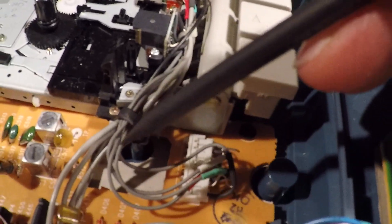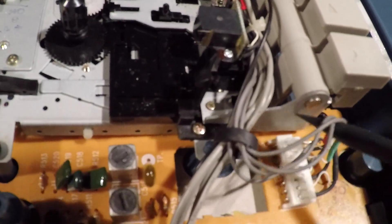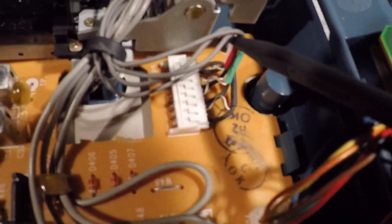So here's the record head — the black right here. I've traced all the little wires; they kind of come out here and then fold back. There are all these little gray wires here, which then come to this connector. Each wire has a black, so I'm assuming each of these blacks are going to be the common ground.